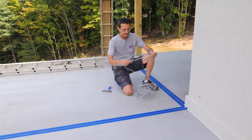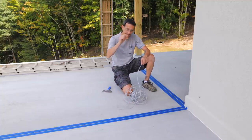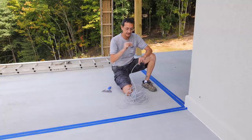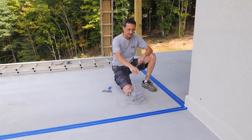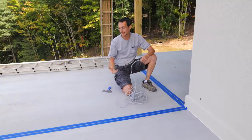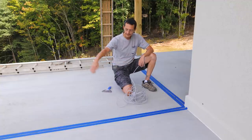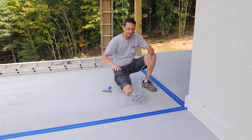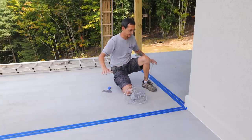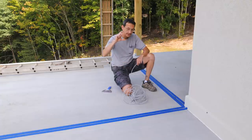And you just take this stuff and you go along, tuck it in down about a half inch below the surface so that you have a half inch of coverage for your caulking. You know, these slabs are about 7.5 inches thick, and these corners are cut almost the whole way through to kind of make them, if they're going to crack, they're going to crack in these joints here in these corners. But anyway, those expansion joints are very deep.